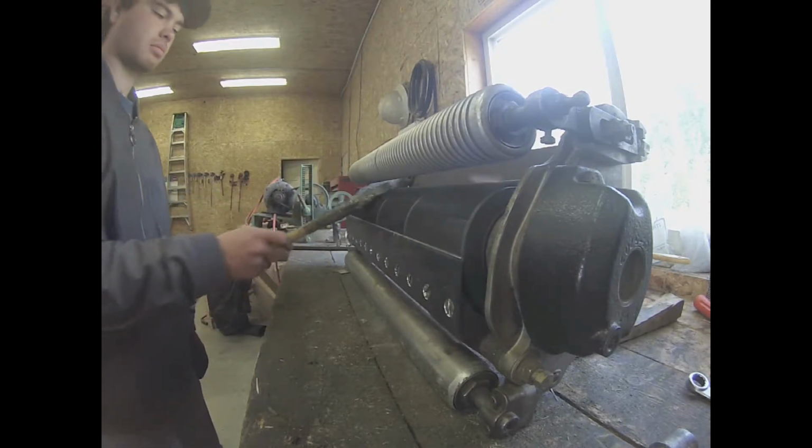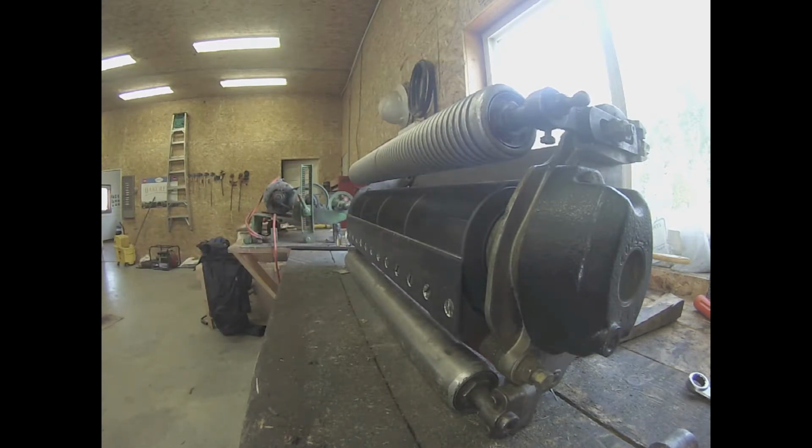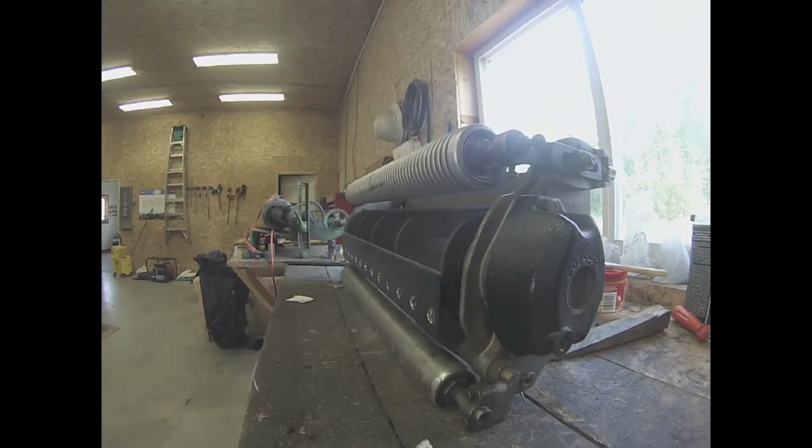I should point out that I have been adding more grit to the reel when it seems to not be making this louder sound when it's backlapping. But of course, when it's been on for a while and I'm ready to check it with some paper, or when it's supposed to be done, I wait for it to get quieter, when it sounds like it's gone through all the grit. That way I'm not wasting any grit.